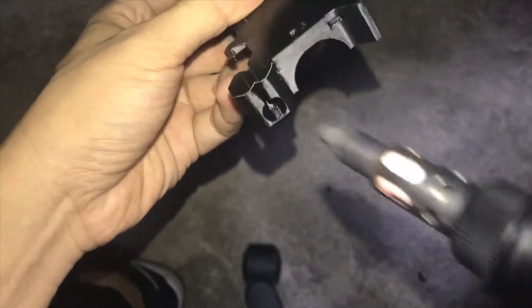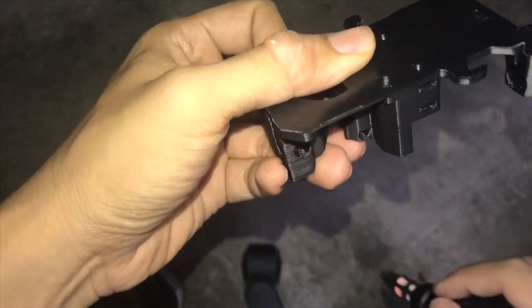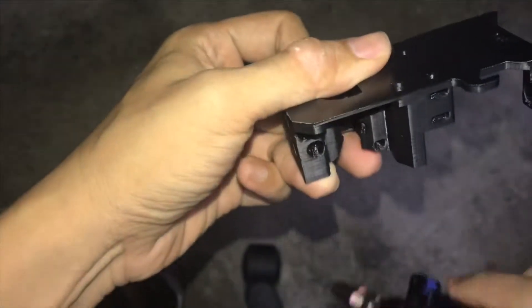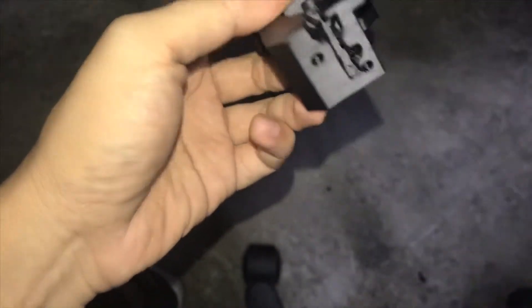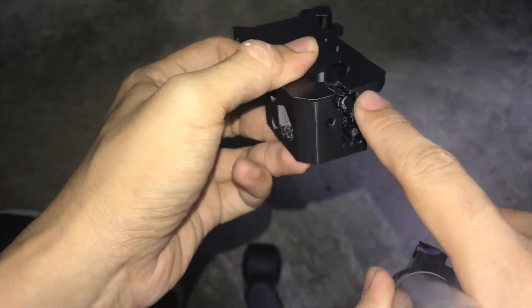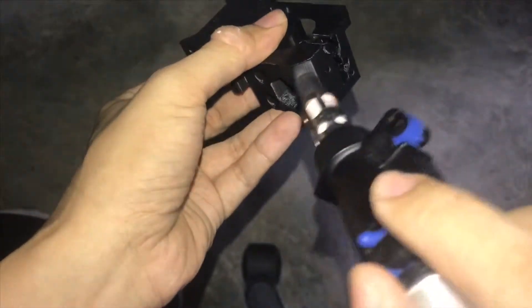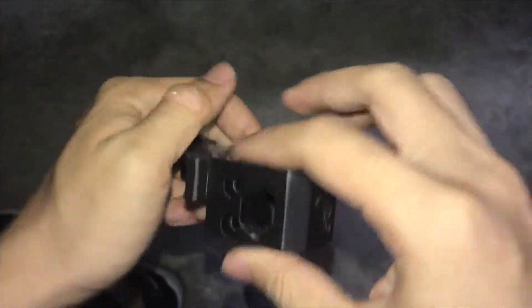You see — the black color comes back directly! You can remove the white line just by using some heat. What you see now is just a reflection, not an actual white line. Compared to before and after, you can see the difference. This is the second tip I use on ABS prints: every time I sand it down and get white color marks, just heat it a little bit and they will be gone.